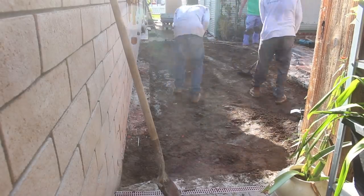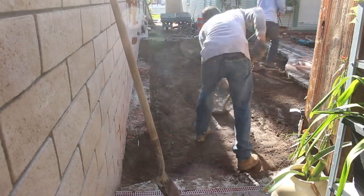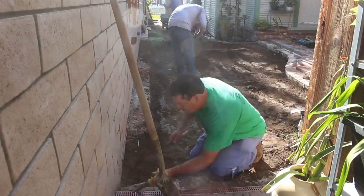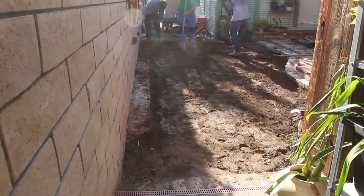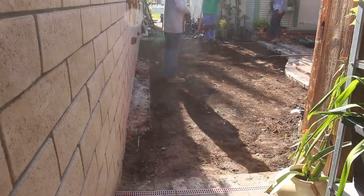Now what we're also going to do is dowel into the existing patio's concrete base. This is really the best way to set brick — on top of concrete. Even pavers, for that matter: if you put them on concrete, you just do it one time and that's it.